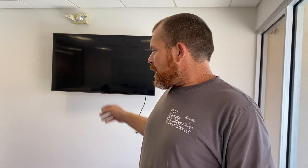I have a box filler on that end, on the right side, which we'll go over when we get to it. And I have a filler on the left, which we've incorporated a little differently to match the column on the right. We'll get to that. A lot of your cabinet fillers will dress to the height of the doors. In this situation, we have it going all the way to the floor, and later on, you'll see why.